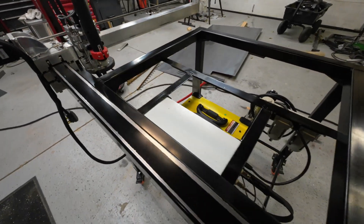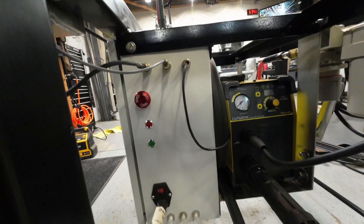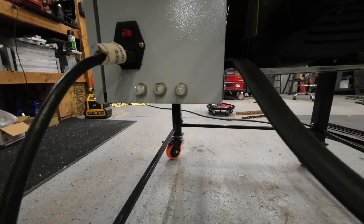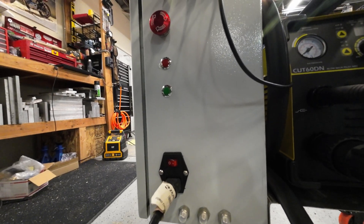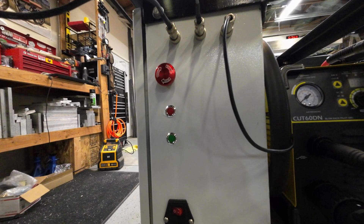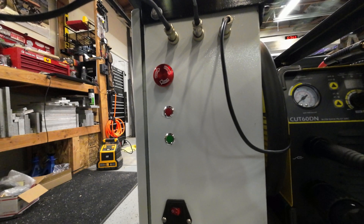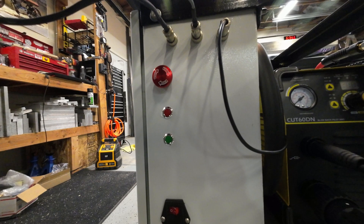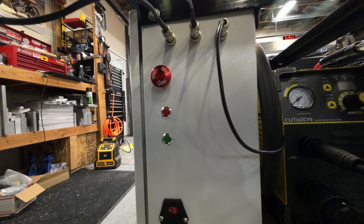Down to the other side of the cabinet — power is fed in here with a 120-volt wall plug. I stole that from my wife's Cricut, or whatever you call it — desk paperweight. The 120 AC is fused at the switch, and below that are circuit breakers for the 24-volt DC loops. Above that, we've got a green power light, a red problem light, and an e-stop which is actually just a hold button. I'll use the power kill on the bottom if I need a real e-stop. The e-stop button here will just put it into hold so I can fix whatever the problem is and hopefully continue cutting. Above that is the Y-axis probe and motor wiring, and also the plasma cutter on-off signal.